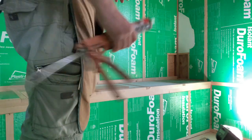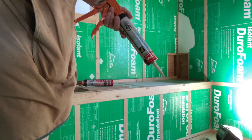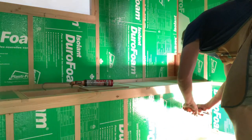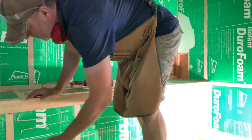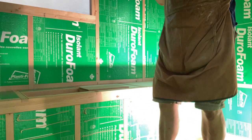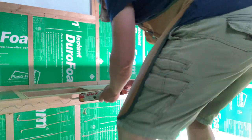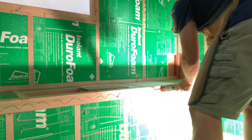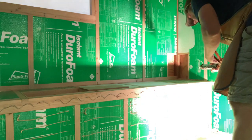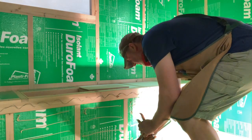I have PL300, which is good for Styrofoam. We're going to make sure we don't get these confused because regular polyurethane adhesive or solvents will melt the Styrofoam, which we don't want. I'll try to avoid getting it on the Styrofoam. I don't want to go too thick because if you have it too thick, it'll really bridge the paneling in here.